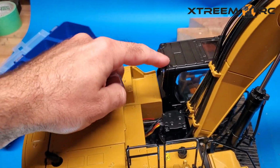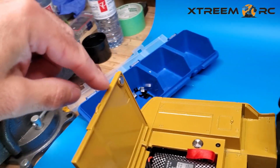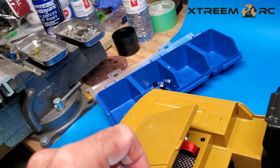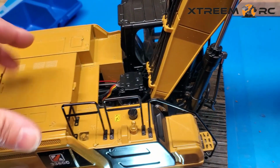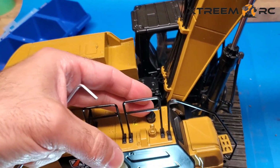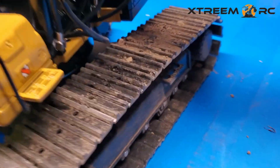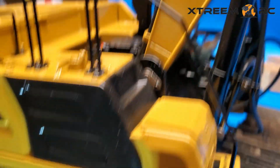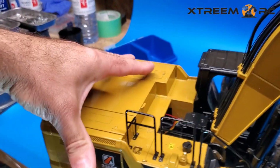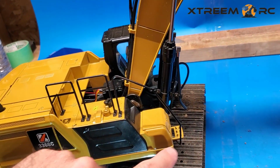And then we'll show how to get that guy off. This screw here, don't touch, because it's to hold with the magnet. That's what the magnet does. And remember, once we've removed the screws, take this oil cap off. Also keep in mind this guy, you're going to have to twist him off. So as you take the body off, turn it, and that will pop off.